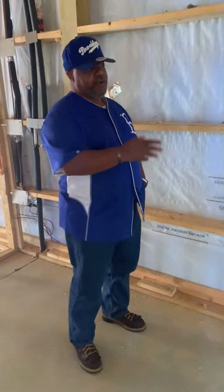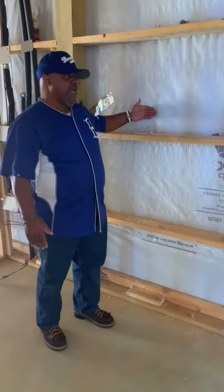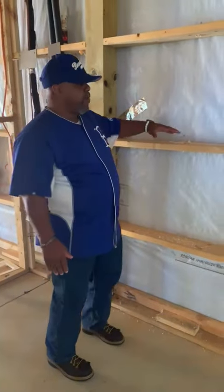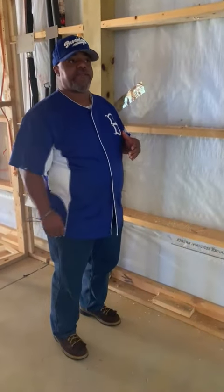And now we're going to let Daryl talk to you a little bit about the interior. In addition to what Ken gave you with our trusses and our design on our poles, in a standard pole barn you have two by eights that are normally attached on the outside of these six by six posts. In our builds, we bring them inside and put them in between, where we can build interior walls completely encasing the unit.